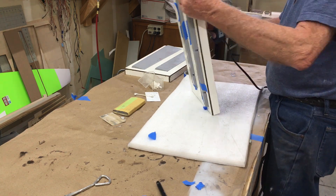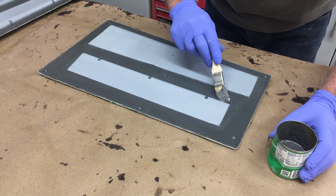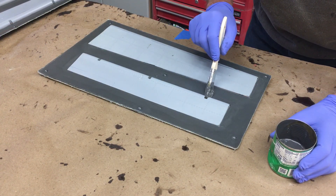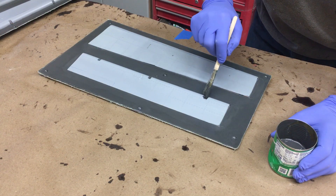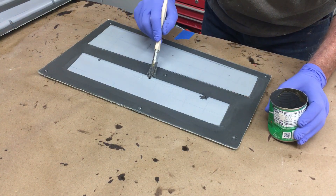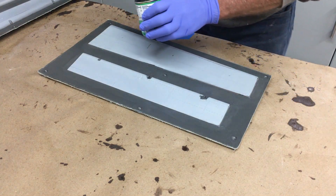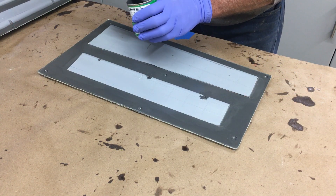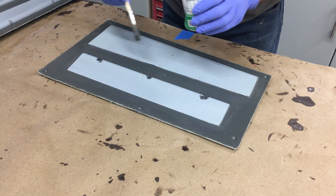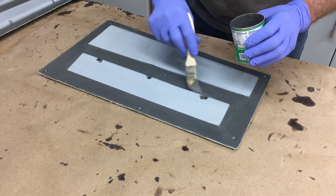The plugs have been put into the parting planes. I've laid up the first half of the mold — as you can see here, I've waxed up this side of the mold, removed all the clay, cleaned everything up, applied the PVA, and now I'm just applying the homemade tool coat. Then we're going to split the mold and start laying up the part. I'm going to blast through this because you've seen it in previous videos — if you haven't watched those I recommend you do.